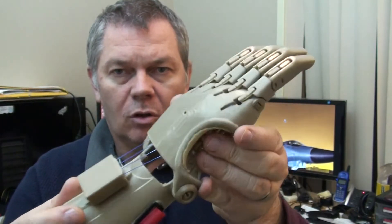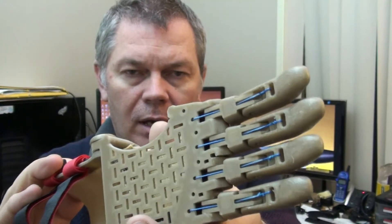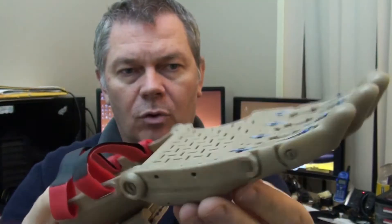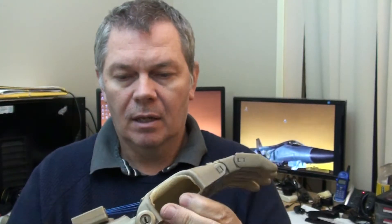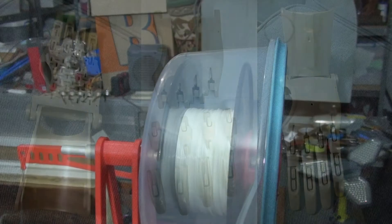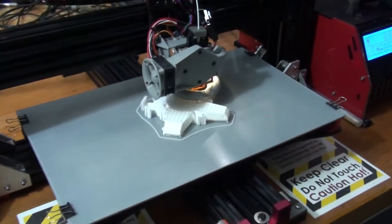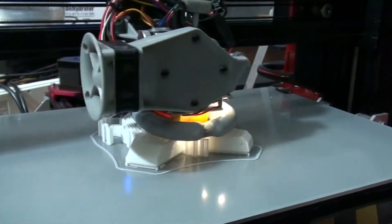The print itself was actually quite good — the tuning of the print was actually quite high. I had little or no artefacts to actually cut off or file. The finish was very good; I used a gold Hobby King PLA which I had well and truly dialled in. The printer I use is a very highly modified Black Widow, which has a very large bed — 400 x 250mm wide — and it actually has a 290mm build height as well, so it's one of the larger printers on the market.